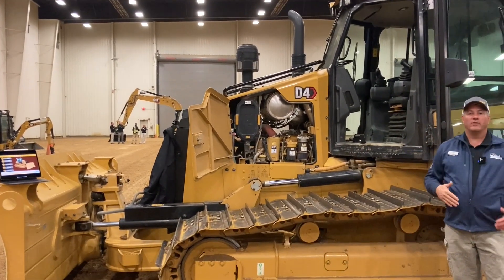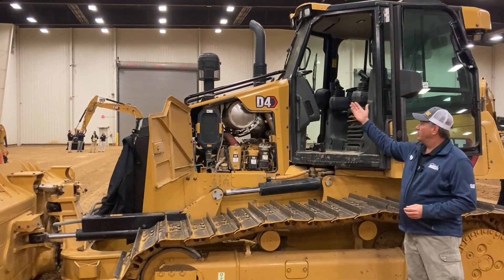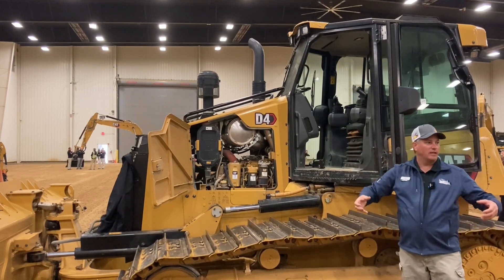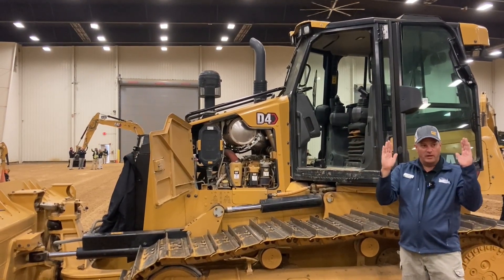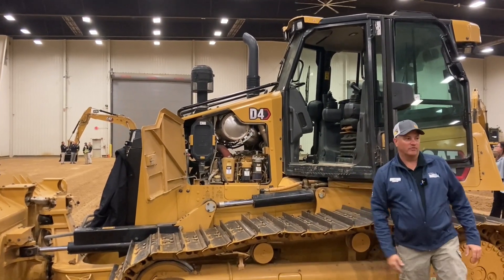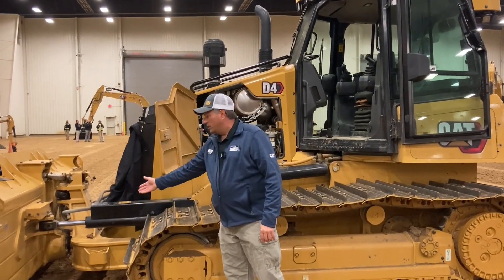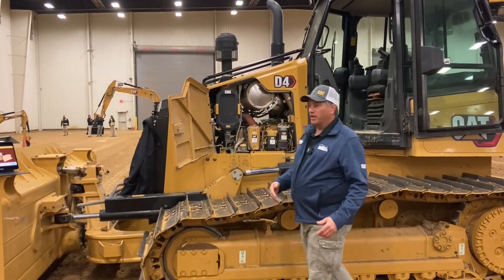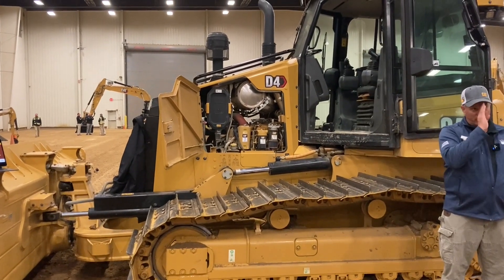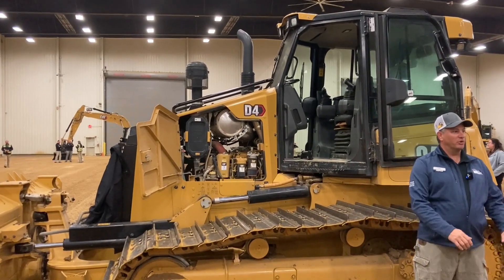That allowed us to drop that nose down and get great visibility all the way around. You'll also notice the air cleaner is on one side and the exhaust stacks on the other side — they're basically lined up with those A-posts up front, so you don't really see those either. Most of the time dozer operators spend their time looking at the dozer tips and what's going on behind the blade to see how much material they're spreading, but occasionally doing land clearing you do want to see right out the front as you're sneaking up on a tree or big brush.